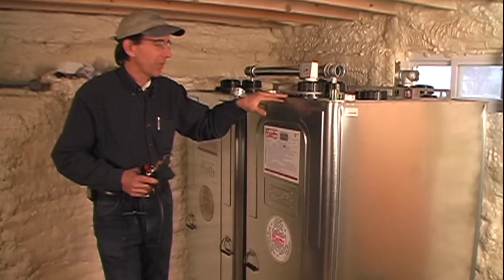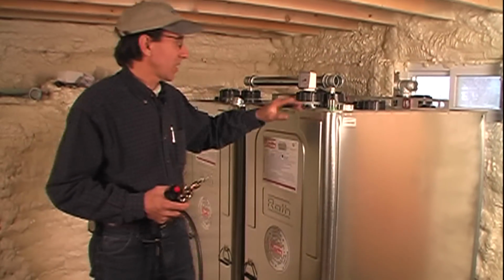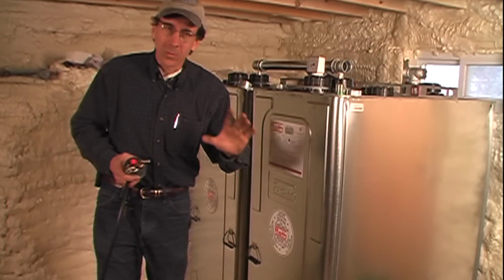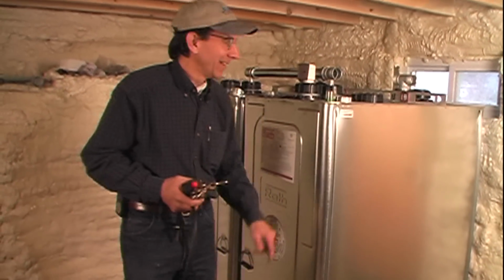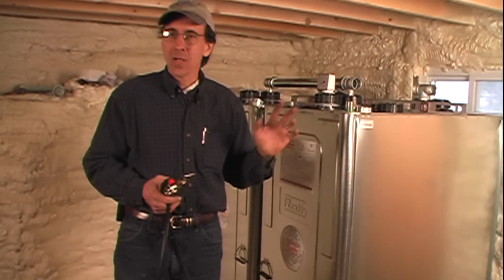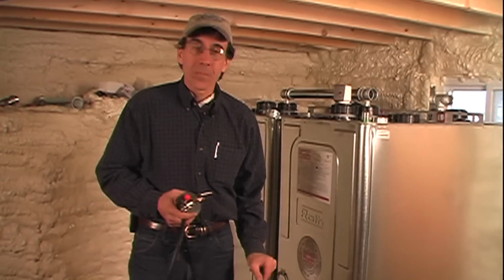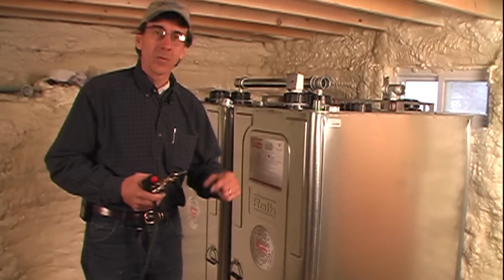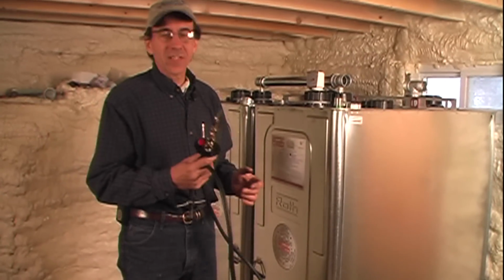The tank, everything goes through the top. Now we used to manufacture tanks for the solar business, and they were unpressurized tanks, not like these, but they were tanks nonetheless. I don't like, as a former tank manufacturer, to poke holes below the liquid level in a tank. If you can bring everything in through the top of the tank, already your tank is a much safer commodity. And when it comes to an oil tank, whether it's a Roth tank or it's a steel tank, the idea of having sludge build up in the bottom means that rather than drawing oil off the bottom of a standard oil tank where all that sludge builds up, if you can do it over the top and if there is any sludge buildup, stay at the bottom, you can be way ahead of the game. So that's exactly what they've done.